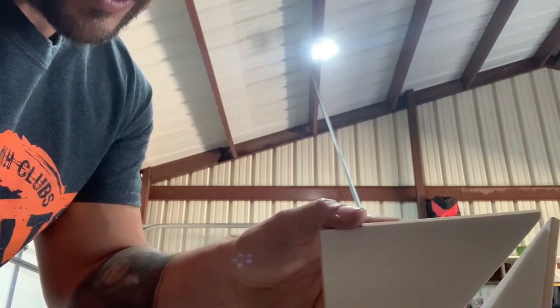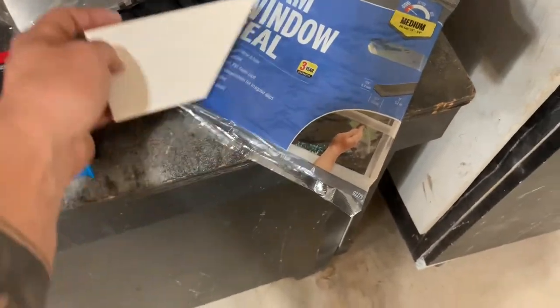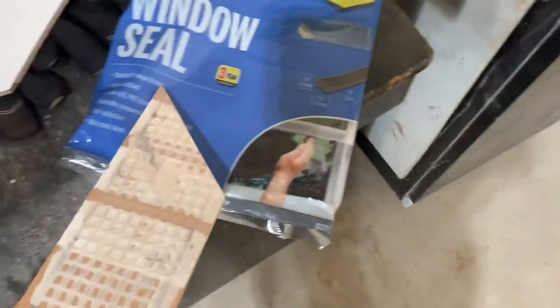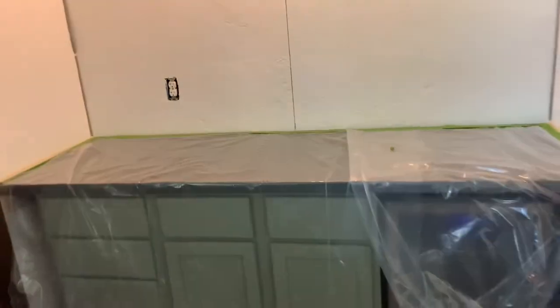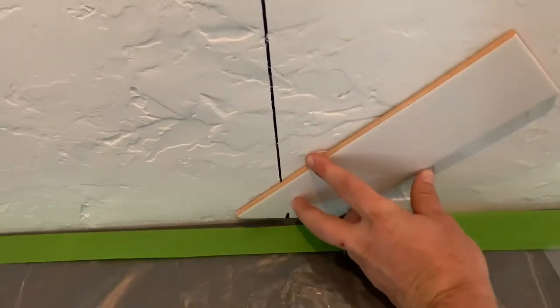Before you start laying, if you have a corner, put a spacer in the wall — you do not want these overlapping, because then your lines from one wall to the other will not match up. I use foam windowsill material. You've got to find something the thickness of your tile — mine is about a quarter inch thick. I cut the foam windowsill in half and put it up in the corner. I also marked the dead center of the wall where I plan on beginning.